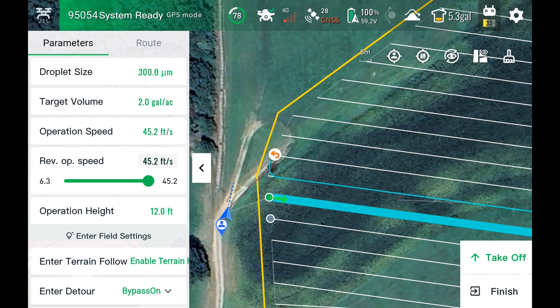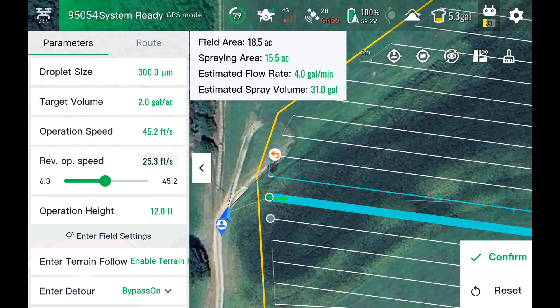Why would you want to do that? Just in case you are spraying into the wind one way and against the wind another way — that might change your pattern or change your swath because the wind's pushing your swath back. You don't have as much downforce. Your relative wind speed is different this way versus that way. If you slow the drone down going against the wind, that will actually help keep your swath more accurate and have less variance between forward and reverse speed.